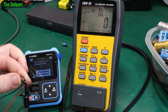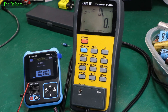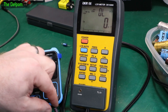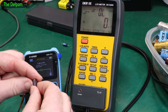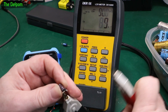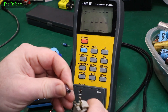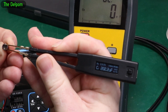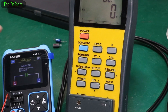Let's get another one. The DSO-TC3 is very slow to test - I do notice that. It says 217 microfarad, V-loss 0.4, ESR 0.4. This is a 220 microfarad 10 volt capacitor. The DEI says 202 microfarads, 3.9 ohms - very different from the DSO-TC3. And the Shannon Tweezer also says 202 microfarads, 3.9 ohms - very similar to what the DEI said. This meter is very wrong.